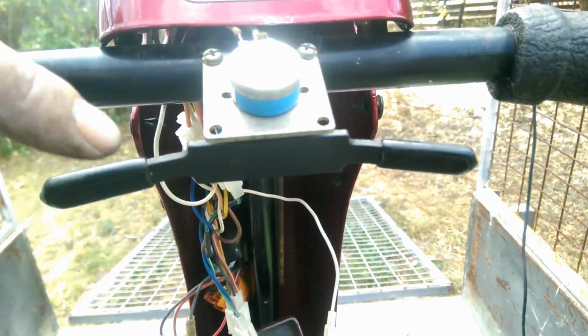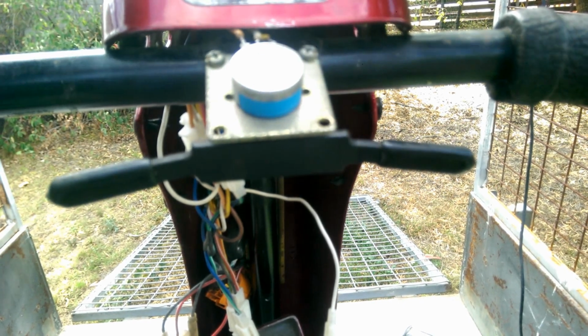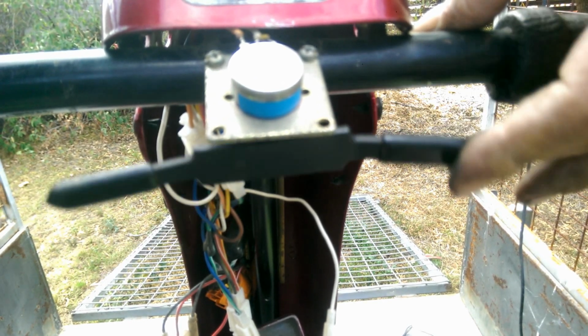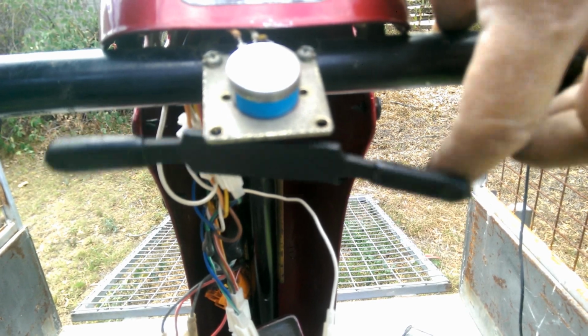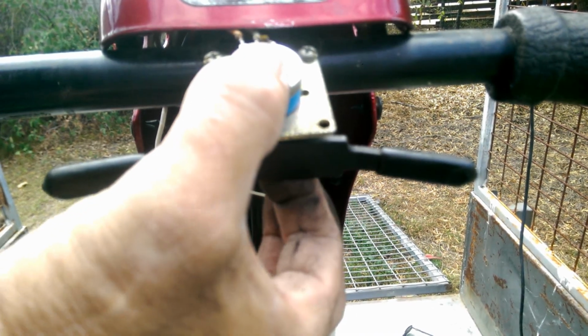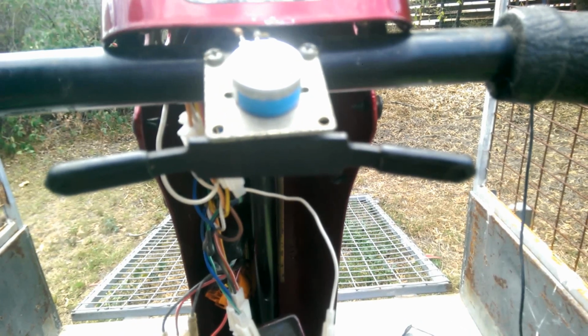Okay, that's zeroed there. Now this is what they call a wigwag, and that goes on up in there. If you just give me a minute, I'm going to go and grab a little Allen key to do up that little grub screw, and we'll get back to that. I've put the control piece on. Now, we're still switched on. Let's see what happens when we hit this. Nothing. And reverse. Nothing. Because there's not enough rotation on the potentiometer to activate anything.